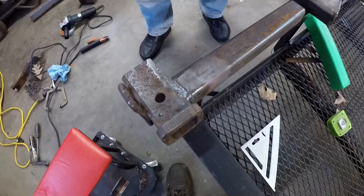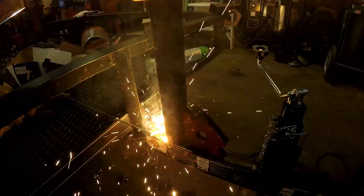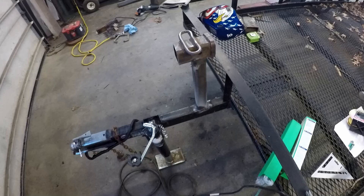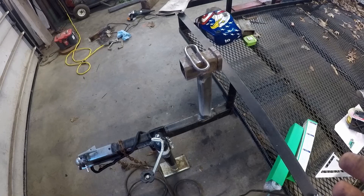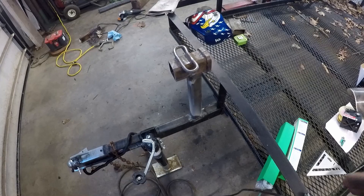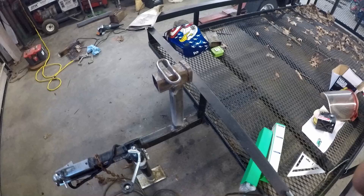The receiver tube is welded to the upright. I'm going to wire wheel this piece real quick before it is welded to the tongue of the trailer. The winch plate is completed - it's welded on both sides. I didn't really see the need to weld it continuous for such a light duty 900 pound winch. Now, slightly questionable if it's going to need a brace running in one direction or the other. I think it's going to be okay because it's only a 900 pound winch. We have a 5000 pound winch on a car trailer and pulled a truck on there with brakes that were dragging - the tires were actually sliding - and it's made out of 2x2, 1.25 inch tubing, braced only to the front rail which is 1.25 inch angle. So that's not a substantial brace. I think this is going to be more than enough.